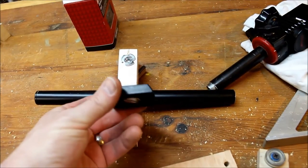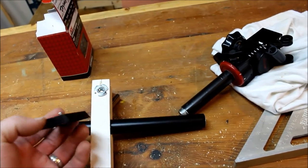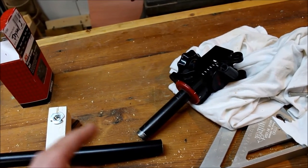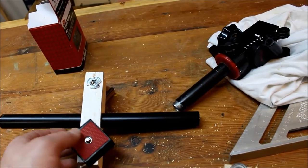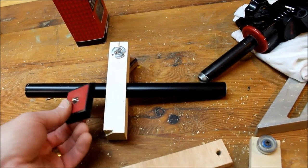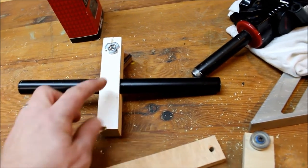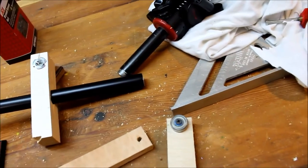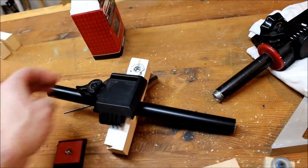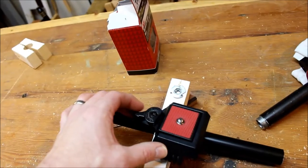This is the part that attaches to the bottom of the camera for the tripod — this is the one I use the most, for this tripod right here. I was going to try to incorporate this into it, but I realized it's kind of heavy and it seems like it's going to be off-center. So I thought it would be easier if I could mount the camera right to this piece right here. I'd like to have kind of a sliding dovetail — this would be the dovetail that would slide into an adapter here, kind of like it does on the bottom base. It fits in on one side and then you lock it on the other side.